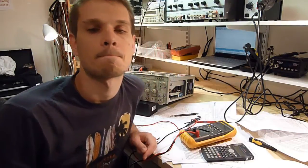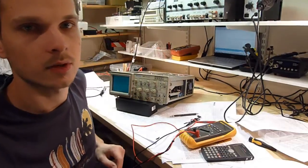Now I'll show you the schematic of the service manual, and then we'll try and see whether we can find out what has possibly gone wrong. I have also been playing with this a little bit, and I managed to probably mess it up even more, because now I don't even get a trace on the screen. It seems like possibly the time-base board has blown up some of the components, and so well, I'll power it up and I'll show you what I mean.